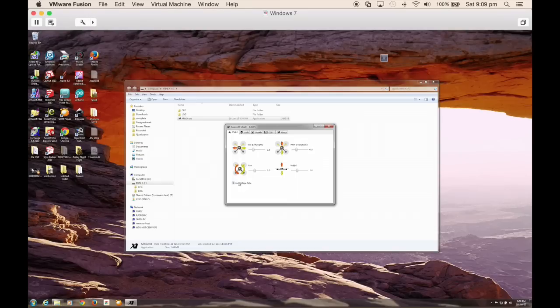There's also a low voltage safe option - I've ticked it because it'll warn you when the voltage is getting low and when it's critical. At 3.6 volts it'll give you a warning, and at 3.5 volts a heightened warning that your battery's getting low. The next one is the safe parameters - how we're going to do return to home in case of a fail-safe or a manual fail-safe. There are four options: return to home with tail in or nose in, hover at 15 meter height offset, or just land in the current position. In my case I've selected tail-in return to home.